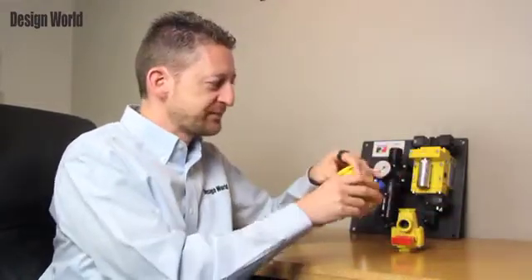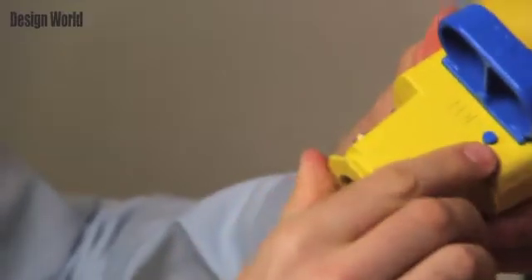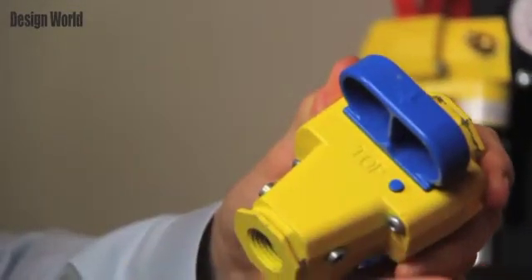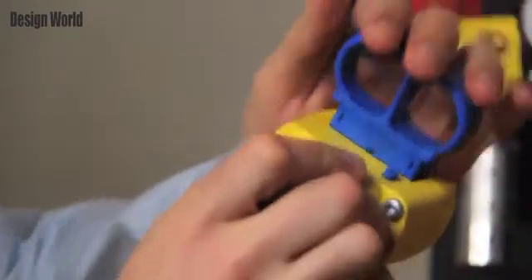We have one other version with an extra bit of safety engineered in. The purpose of this blue handle is to slowly ease on the air to the work elements. This prevents the cylinders and other work elements from slamming. You pull the handle halfway up to slowly ease the air on. Once the work elements are in their normal position, you can push this blue button located on the top and pull the handle at the same time to enable the full flow of air.